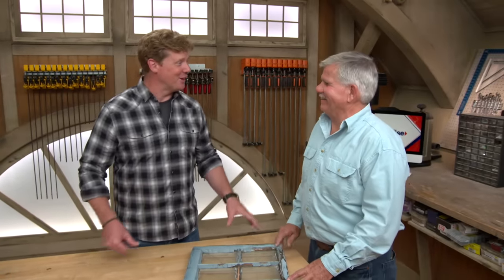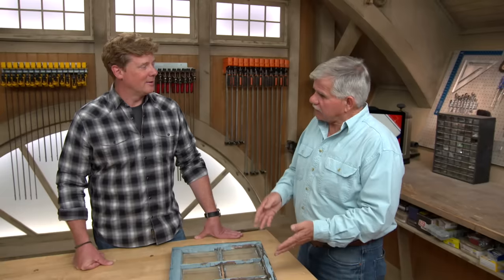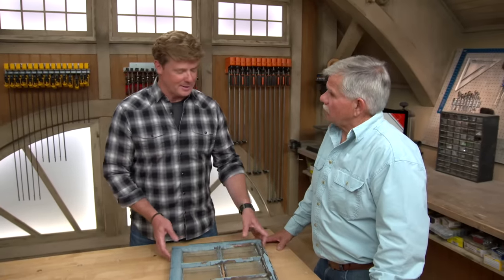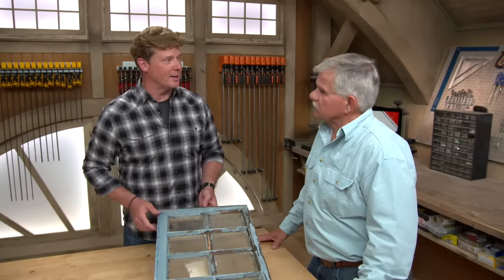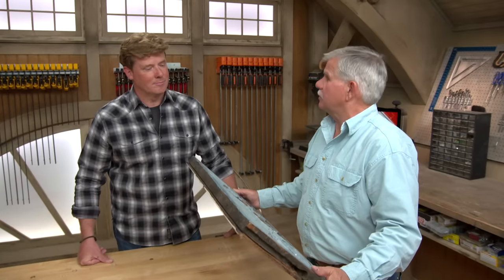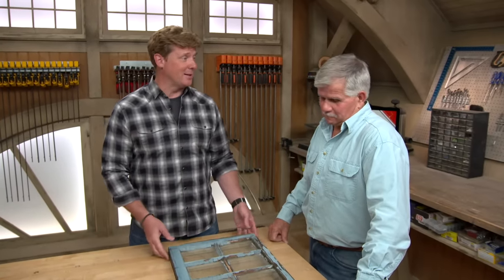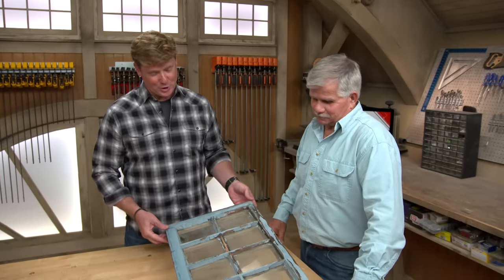It is a pleasure watching you do even the simplest of tasks, and not an expensive fix either. It's actually a pretty easy fix. With the glazing compound, the glass, and the glazing points to hold the glass in place, you're probably looking at less than $30. The most intimidating thing is whether or not you feel comfortable cutting the glass, which is actually pretty easy to do. But if you're not comfortable cutting the glass, you can go to a hardware store with the right dimensions and they'll cut a piece for you. There are millions of windows built like this, and if it's single pane with glazing, you can do what we just did. Recently — last 20, 30, 40 years — our windows have changed significantly. It's typical now that we have two panes of glass: insulating glass, sometimes three. That's a whole different fix. You get the sash out, get the dimensions, go to the manufacturer for a new sash, and then screw or attach the new one back into the old frame — not as inexpensive as this fix. But there are still millions of these single-pane windows out there, so you're going to be able to use these techniques on a lot of windows.